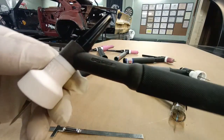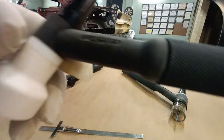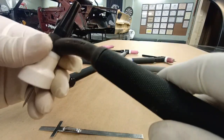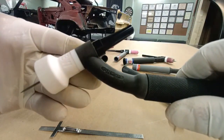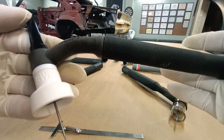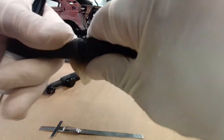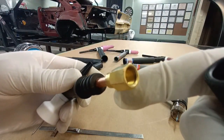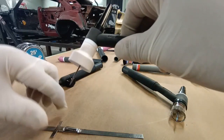This is our last 2-series torch, the 9F, and the F denotes 'flex.' Torches come in two styles: a rigid head and a flex head. The flex head gives the ability to bend and angle the torch in any direction you'd like. You don't want to over-angle it though — they do wear out and fracture, so keep that in mind.